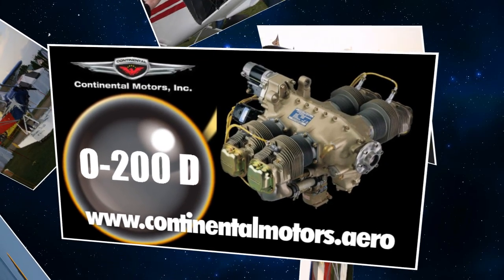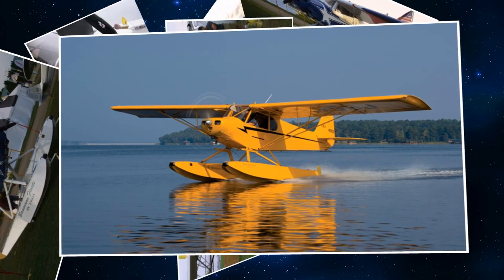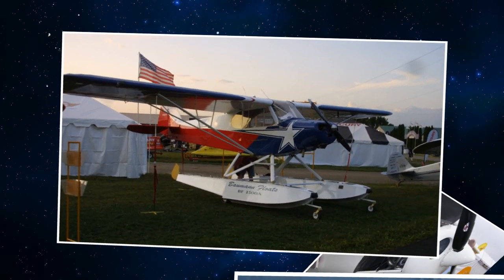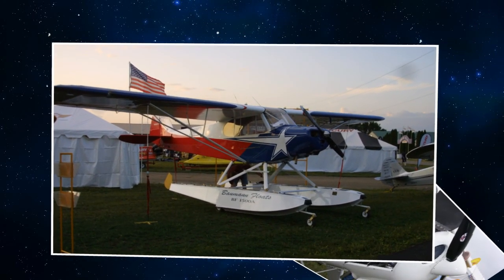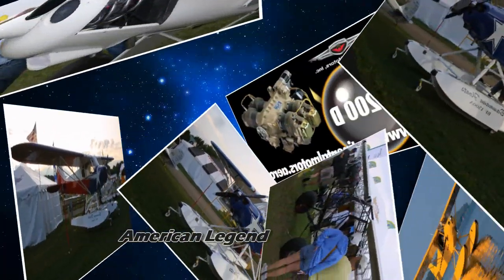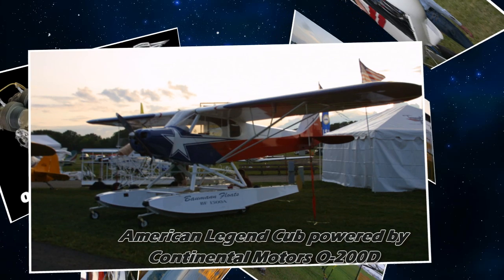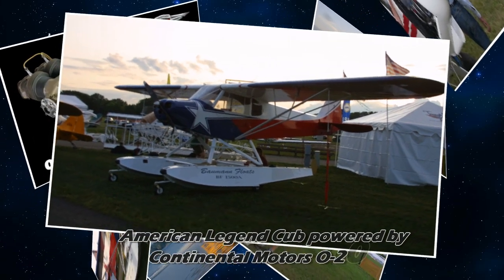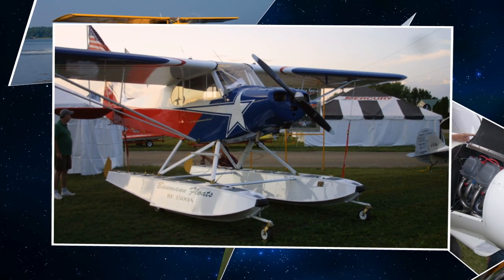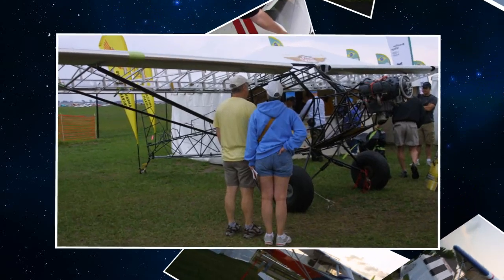Those are pretty big deals, and things you can't see visibly. During that process you have to do a lot of stress analysis, because we all know the old O200 and all the small series Continentals were very reliable — they'd run forever. So you take weight out, you've got to make sure they'll still run forever. There's a lot of engineering that has to take place, so we did a lot of in-house design testing, testing the engine and components, strain gauge work, testing crankshafts and different components.